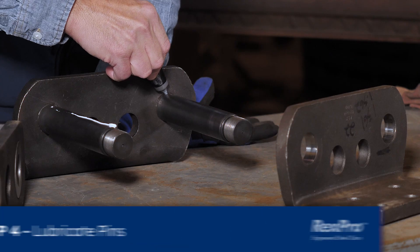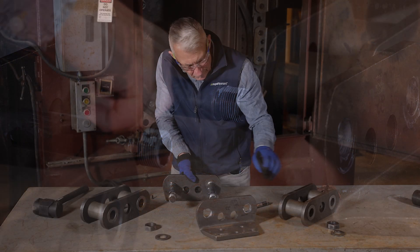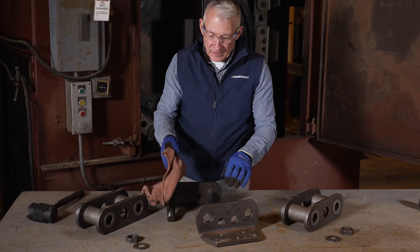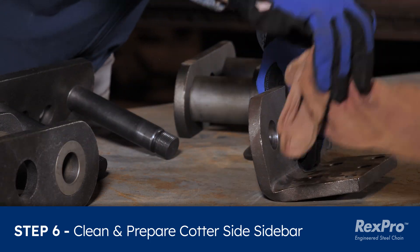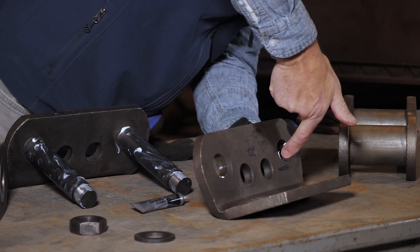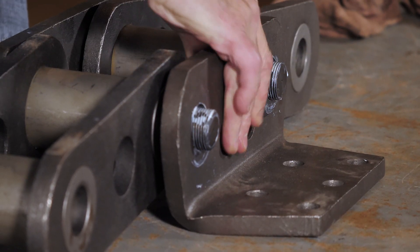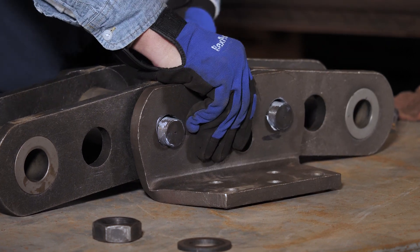To aid installation, generously apply lubricant from the tube to the pin threads and the exposed diameter of the pin. Bring the block links of the chain sections to be joined together so that the pin link pins line up with the bushings of the sections to be joined. Slide the pin link pins through the bushings. Using a clean cloth, wipe clean the pitch holes of the cotter side sidebar. Pitch holes should be clean and free of debris or contaminants. Apply lubricant from the tube to the pitch holes. Insert the cotter side sidebar onto the pins; the pitch holes should align with the pin diameters. When complete, the pin shoulder should be partially inserted into the cotter side sidebar pitch holes. It is important to make sure the stamp faces outward and that the attachment orientation of the connection link matches the other links in the chain segment.